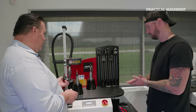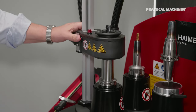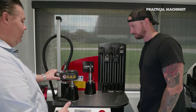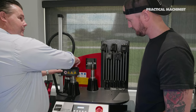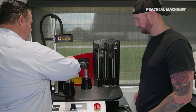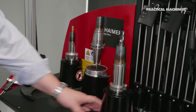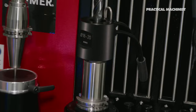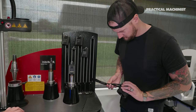For example, with this 8mm tool, I drop in the right stop disc, bring the coil down until it stops right on top. Shrink fit is very consistent — I simply hit the heating button, run a predetermined heating cycle, and the cutter comes out in about three or four seconds, giving me plenty of time to change to my next cutting tool. As soon as I did that, the refrigeration unit turned on. We're circulating coolant through these cooling bodies — it's a non-contact system to evenly take the heat away from the holder and maximize runout accuracy to 3 microns or one-tenth.